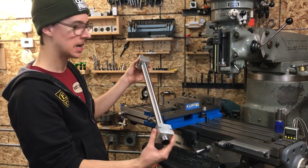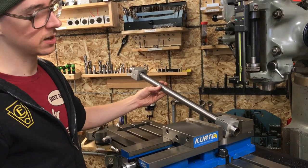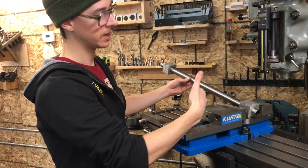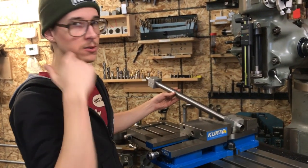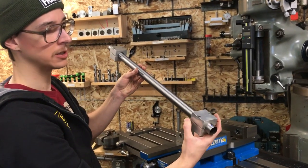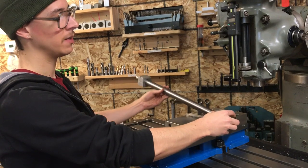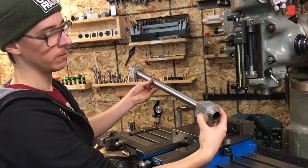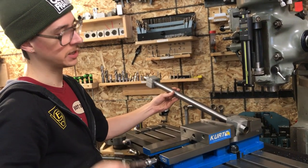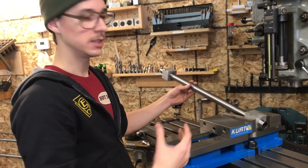With this in here and the two ends locked and phased toward each other, you just set it in here — you want it hanging out of the vise a little bit. What makes a Kurt vise really nice for this is that you can load just one side of the vise and the moving jaw is not going to get totally cocked sideways. If you're using a drill press vise or some other vises, sometimes that will happen — it's only pinching on part of the tubing block because the jaw is crooked, and then it wants to pivot around that point instead of bearing evenly across the contact area. These vises are great because you can just grab on the one side and it usually holds quite rigidly. If you don't have that, you just need to pack the other side of the vise to get a nice hold.